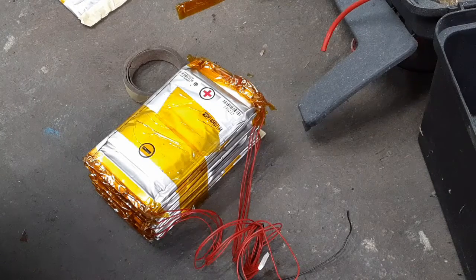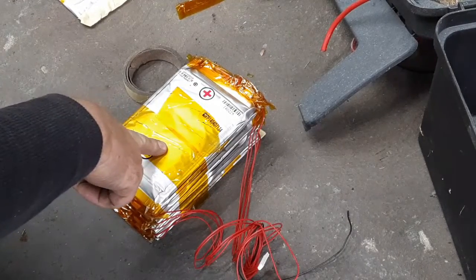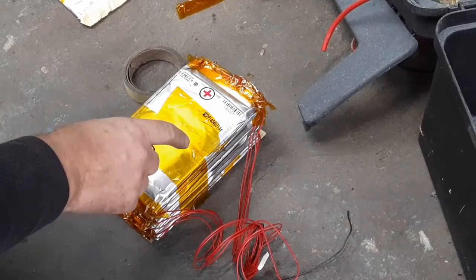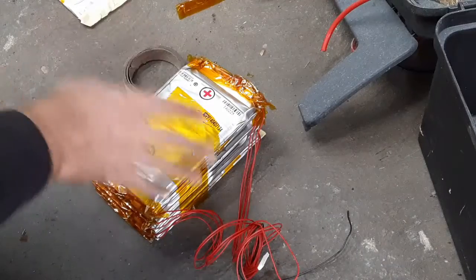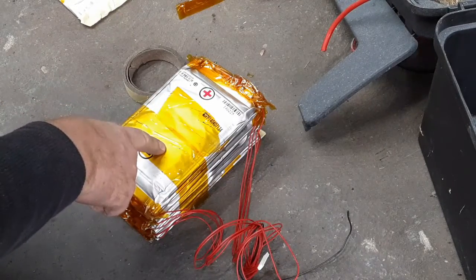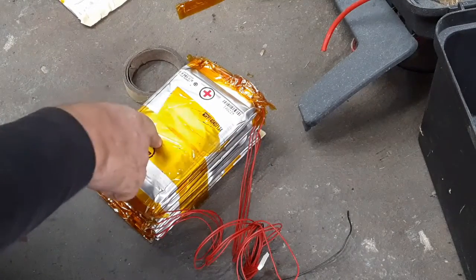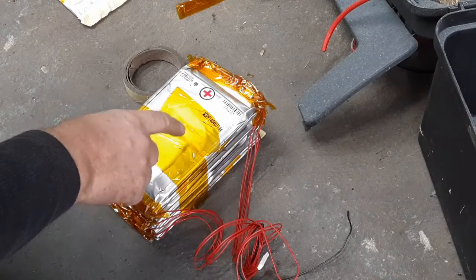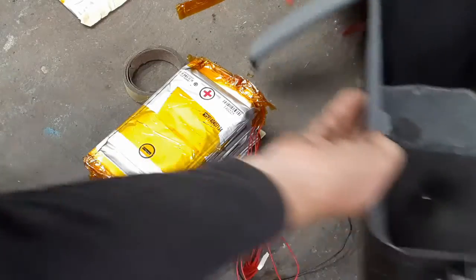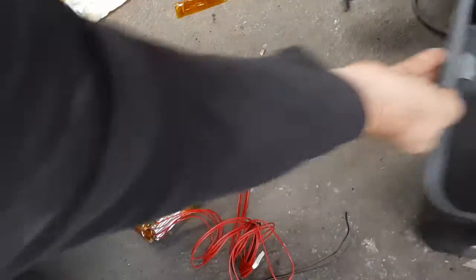I've had my first battery failure and I'm not completely surprised. This is one of the first batteries I made for my solar install. I'm not sure if it's something I did, a failure of the BMS, or one of the cells, but it started discharging every night and bringing down all the other battery packs to their lowest limit. It had about 14 volts in the mornings — supposed to be a 48-volt battery — so I pulled it out of the system. It's one of my quick-detach ammo box batteries, so it's easy to just unplug it and bring it in.